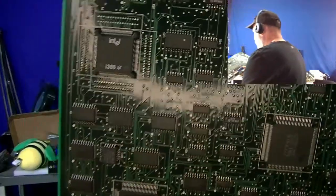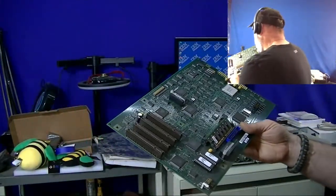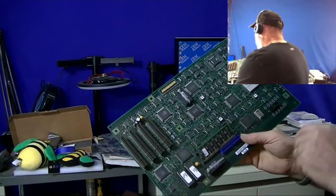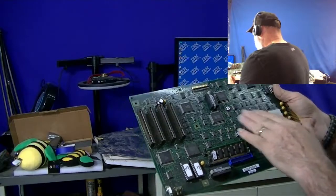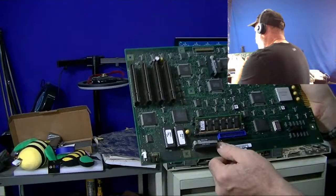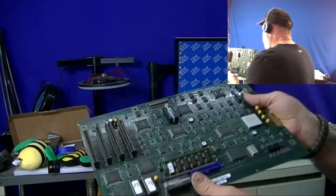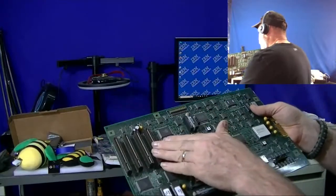And it's got even some of these support chips, these ASIC chips. I think one was on the 55SX PS2. You have some non-volatile RAM modules for holding the configuration. So this is very PC-like. In fact, it has the microchannel bus on there.